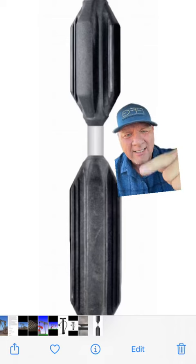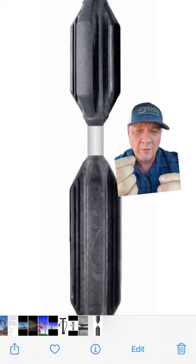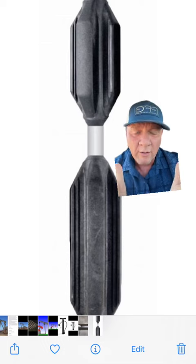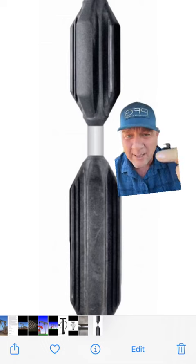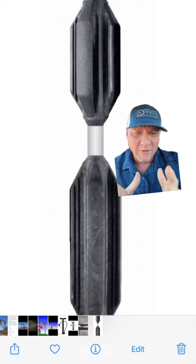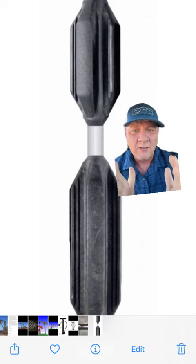We use scientific modeling to determine how to put the rods in the well. You'll have what's called a tapered string — some one-inch size rods on top, maybe some seven-eighths in the middle, and some three-quarter inch rods on the bottom. Some of these rods have guides on them. These guides prevent the steel from the rod from rubbing against the steel in the pipe in the well, which can either wear a hole in the pipe or snap the rod in half. You typically install your rod guides in areas of the well where you have a lot of deviation — basically where it's not that straight.